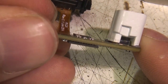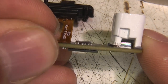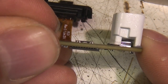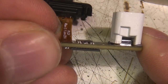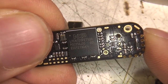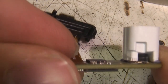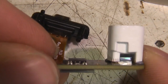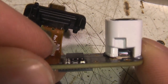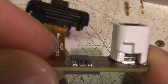With the shutter out of the way, we get a slightly better view of the sensor. It's quite thick, and the construction looks quite similar to what we saw in the E4, layers of silicon or similar materials. So that will have the vacuum cavity in there, and probably some electronics built in. There's no other obvious electronics on there, so it's fairly thick, I estimate nearly 3 millimeters. It looks like a stack of a few different layers, but these are obviously manufactured on one big die and then sliced up afterwards.